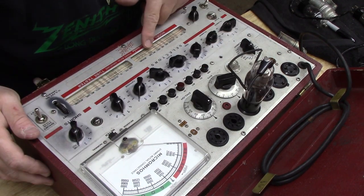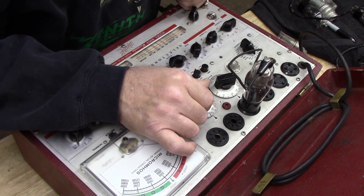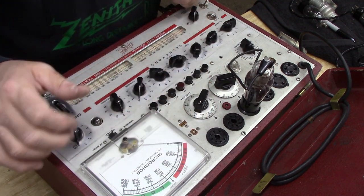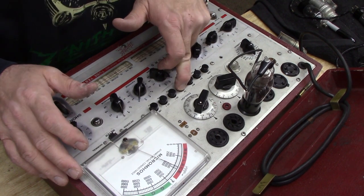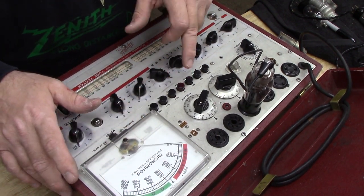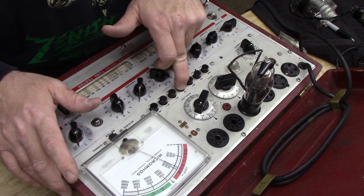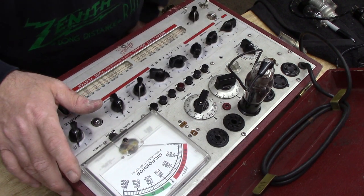6F7. Now it's supposed to have an 1100, so that means that again would be the low red dot if I want to read the number. Low. Now let's check it again. I'm reading about 950. So 950 is not terrible. I think I could probably live with 950 in an old AM radio. It's probably going to work fine. It's supposed to be 1100 and I'm reading 950.